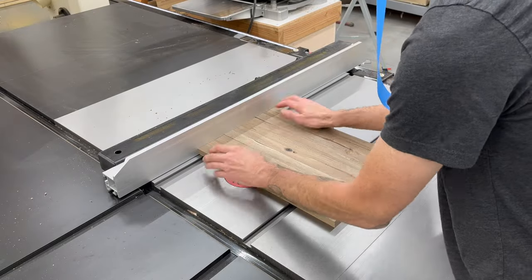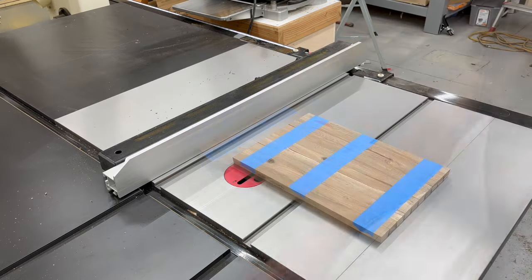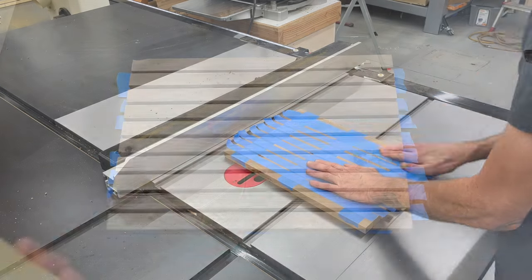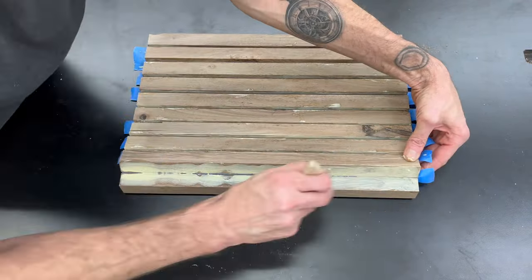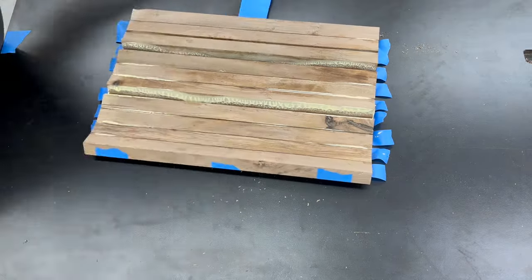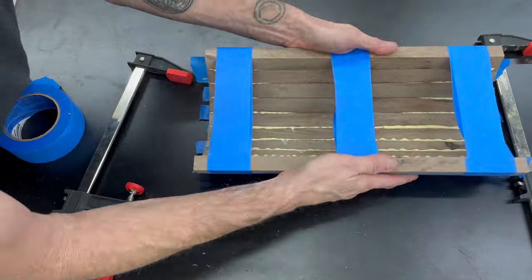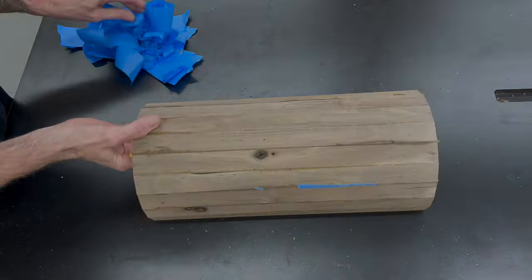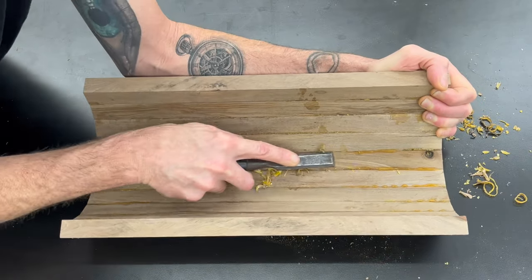Once you get all of those cut up, we can get them taped together. I suggest lining it up against the table saw fence so you can keep them all straight and square. Once we get all the pieces taped together, we can get the glue in all of the grooves. Try to spread it around evenly with a brush to make sure it's nicely coated. It was a little too wide to get my hand all the way across, so I ended up putting a couple layers of tape to get it tight. I then let that sit overnight before taking the tape off. It was a little bit of a struggle to scrape the squeezed-out glue off the inside where it's concave, but it wasn't too bad — it took me about 10 minutes.